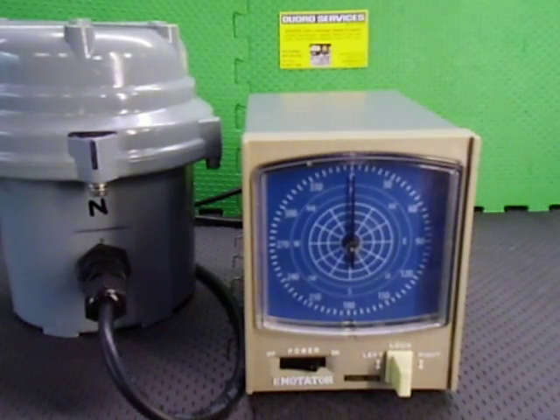The standard controller was upgraded to a high-low dual speed configuration in the direction switch. The direction switch is in two stages: first low speed, then high. The low speed is 12 volts at 75 seconds for 360 degrees rotation, whereas the high speed is 28 volts at 35 seconds for 360 degrees rotation.